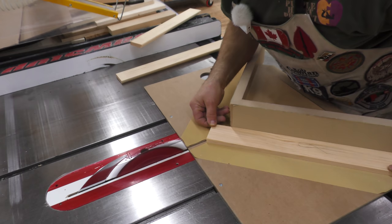That's perfect. Love it when that miter goes together like that. Part of the fun of woodworking is to learn how to fix your mistakes. Not necessarily a mistake, but I didn't plane that inside edge like I told you. And if you try to do it now and you're resting that sharp point, which is critical to a nice tight fit, you're going to possibly damage it.